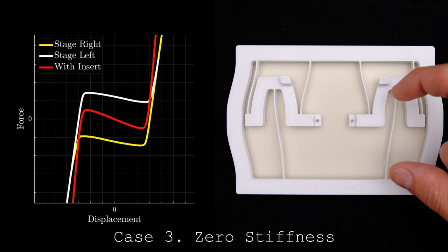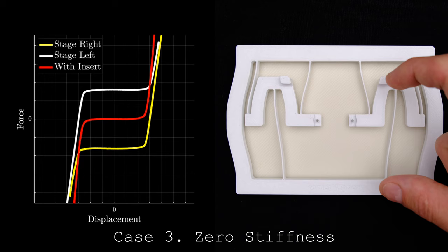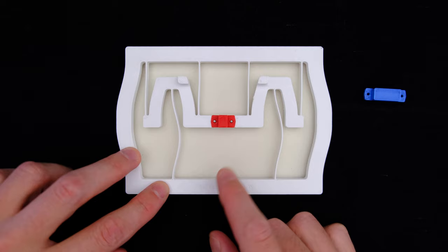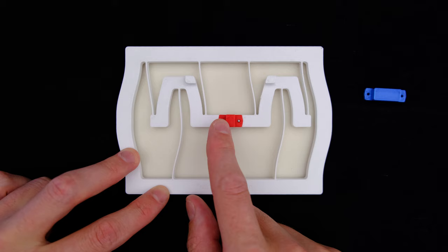If we can continuously change the slope of the middle section by changing the length of the buckled flexure, then there must be a length for which the slope is zero, and this is exactly what the last system is tuned for. This is an example of static balancing. In a statically balanced system, all forces are at balance over a range of motion. You can compare a perfectly balanced system like this to a ball on a flat surface, as opposed to a ball on a hill.